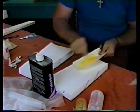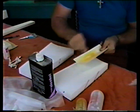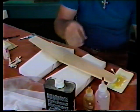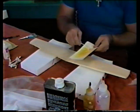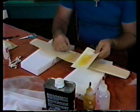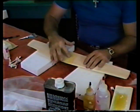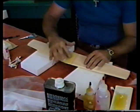Okay, we're mixing this up real good. The easiest way I know of to do this is get it up on two foam cores, so you have the middle. Get on a little bit of the epoxy. Now the idea when you're doing glass cloth is to get it to end somehow other than just in a rigid stripe, because it's hard to get that stripe out. You want to kind of fade it in, fade it out.